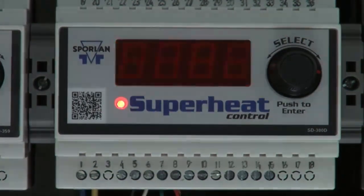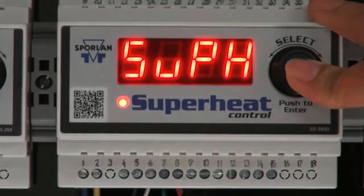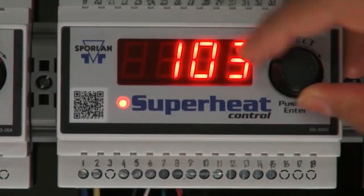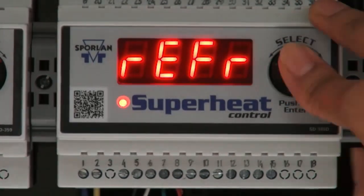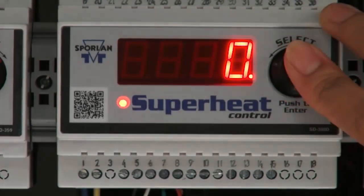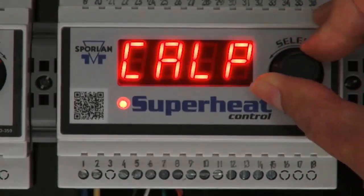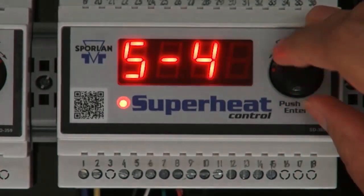STEP should flash like before, prompting you to select your settings. When I did this, it took a little over a minute. Now run through the values, keeping them on the defaults, then enter into the set point menu and go through those values as well. Remember to rotate then press the select knob in to change any values, then press the knob in again to save. When you're finished, rotate to ESC and press the select knob to save all changes. Then you can rotate through your saved parameters and press the knob in to view the values.